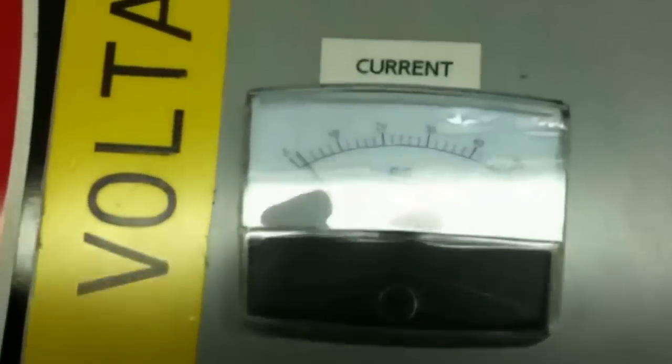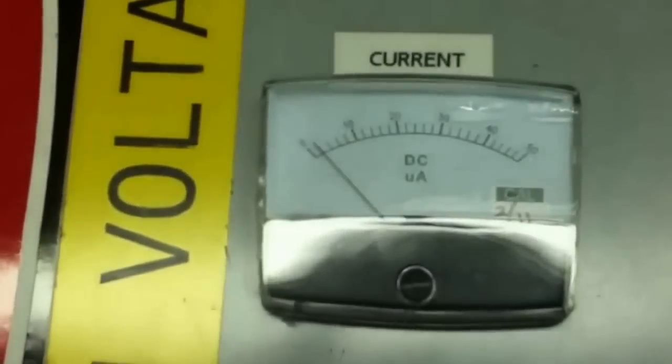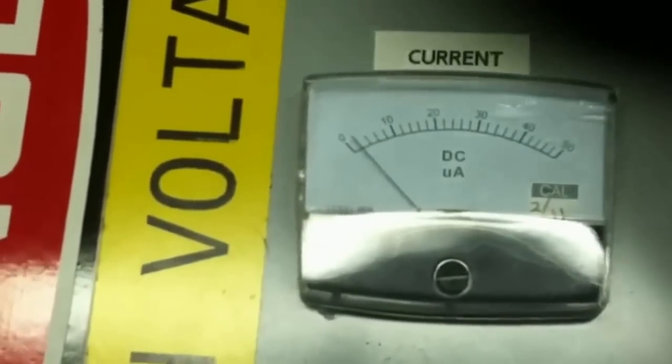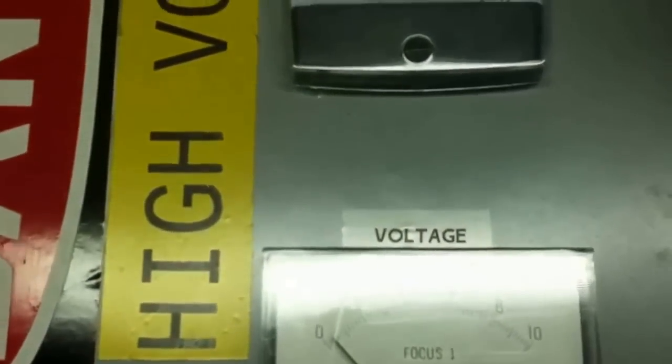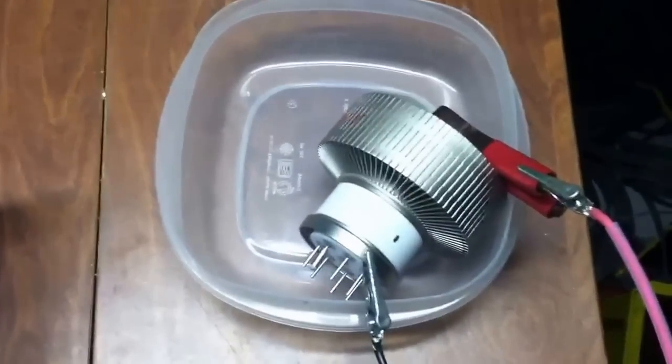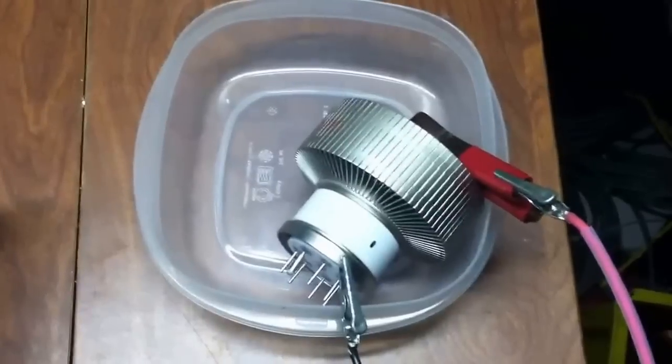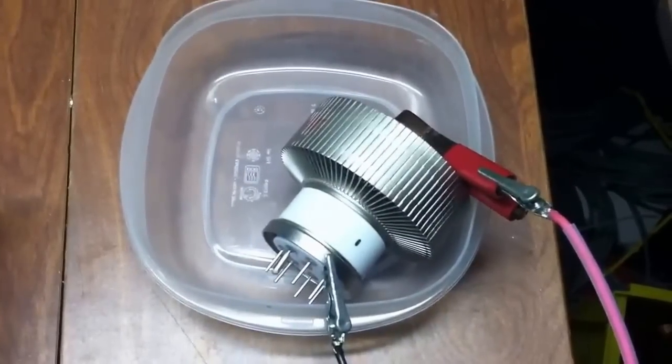There's 5000 volts and only about two microamps of leakage current, so that's terrific. So at least with these few simple tests you can have some degree of certainty that your tube will be good when you put it in your amp, and not have anything short out.